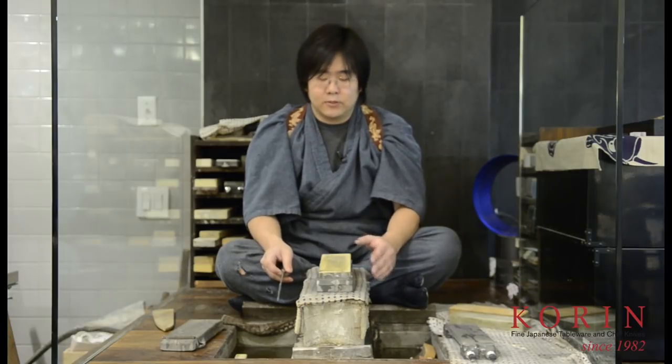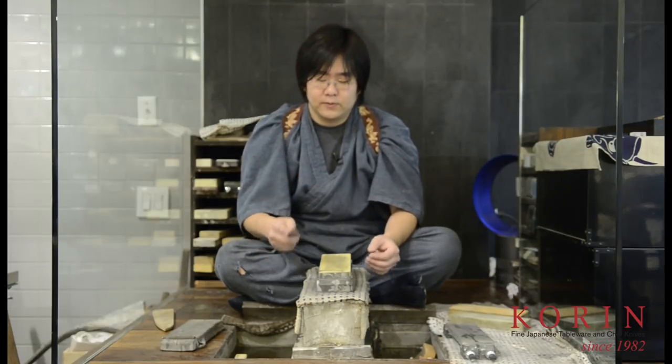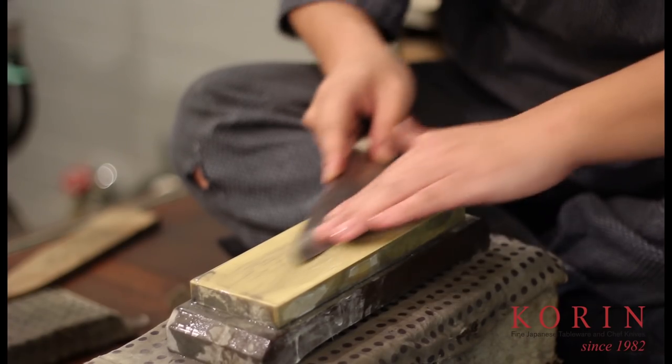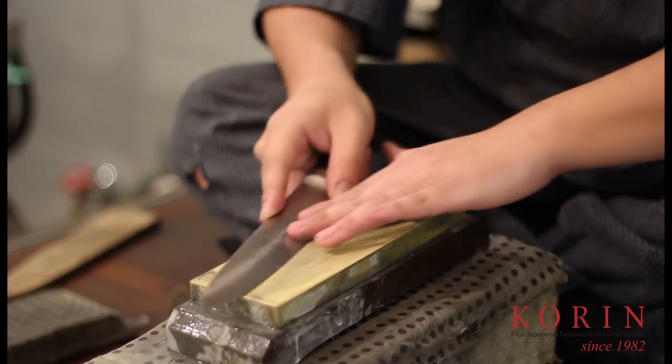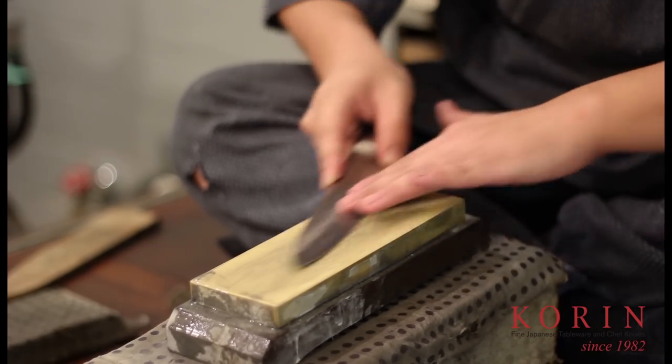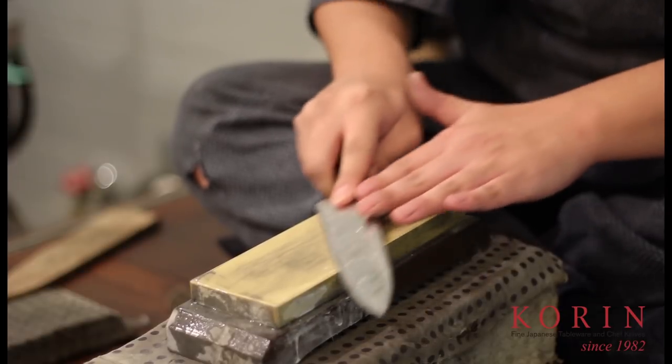But the way I recommend is the way I'm going to show you right now. If you use a finishing stone and polish your knife, the burr that you're going to get on the finishing stone is going to be much, much finer, and that's also going to be easier to remove. So after polishing on a finishing stone, you want to do the same thing that you did with the medium stone — removing a burr by pressing very, very lightly, and that's naturally going to start to remove the burr.